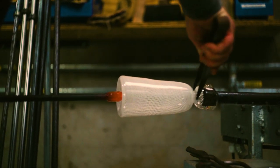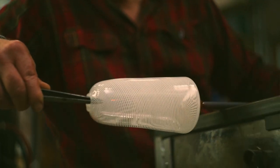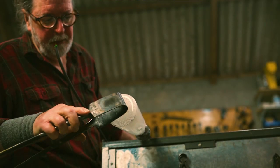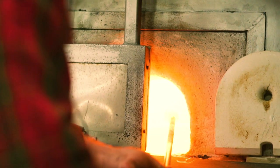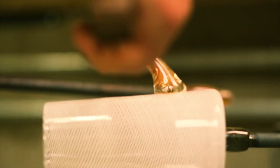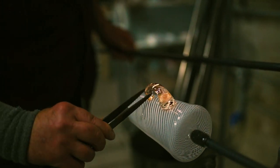What we make is a variation on traditional ways of working with glass developed by the Venetians. They found a way of getting the pattern into the body of the glass itself, as opposed to engraving or painting it when cold or using a decal. The body of the piece is made of separate pieces of glass that form the pattern. As the form evolves and you stretch the glass, the pattern stretches — it's mapping the surface of the glass, reflecting that fluid process of glassblowing.